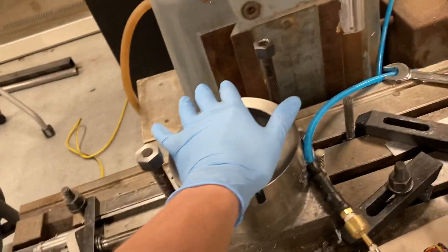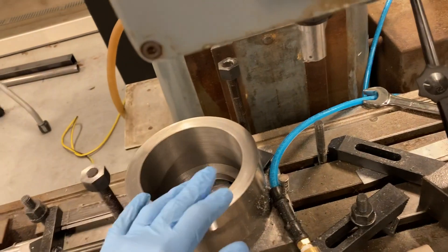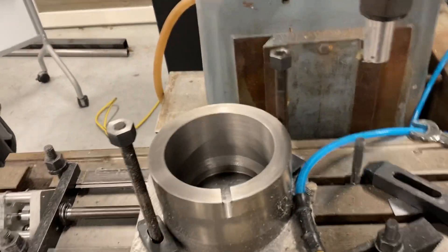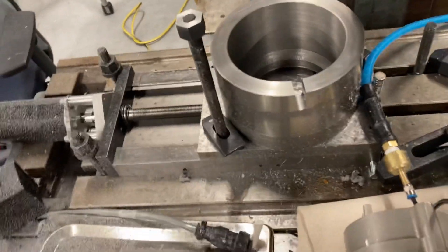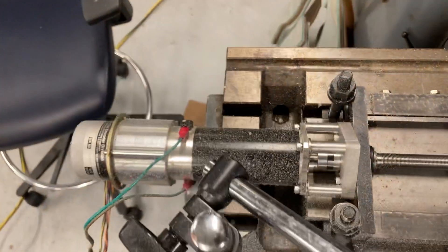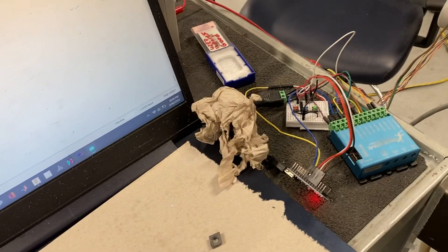The spindle goes on here, mounted vertically, held down with a couple clamps on either side. It really doesn't need much clamping force because everything is so low force — just something to hold it in place and stop it from moving around. It's the same servo-driven axis as you guys have seen before. And what I've done is I've got it hooked up to an Arduino here. This is a very janky temporary setup, but I made a little program just to generate some pulses to drive the servo.